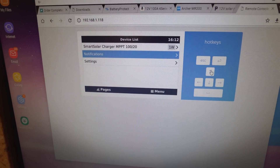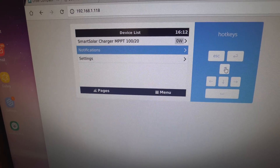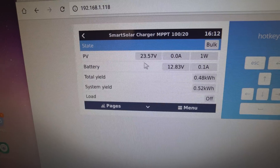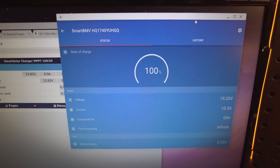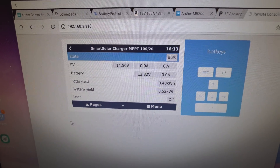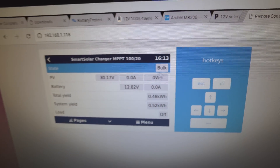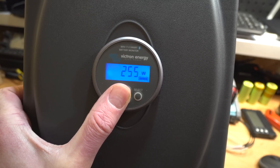This is software from one of Victron's hardware controllers, but you can run it on a Raspberry Pi completely free — you don't have to buy the dedicated bit of kit, which is about £500. The manufacturer Victron supports it, which shows how good they are. You can see all the stats of the actual system. Battery amps are done by Bluetooth so you're limited to that range, but this one you could access potentially from anywhere. It's on bulk charge at the moment. I've cranked the charger up to about 17 amps and you can see about 262 watts going in.